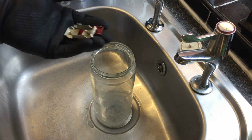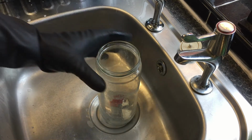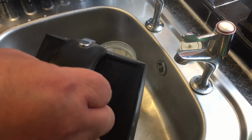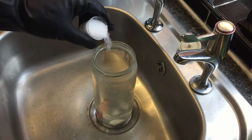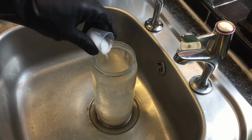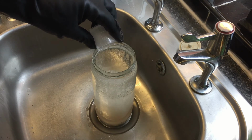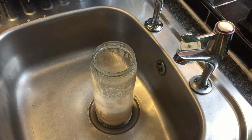So welcome back to the lab, folks, and here we are with our parts, and we're wearing our PPE as always. Drop our parts into our caustic soda jar, add our boiling water, and of course our magic ingredient. And we'll give that our mandatory 30 minutes, come back and check, and then I'll meet you back at the bench.